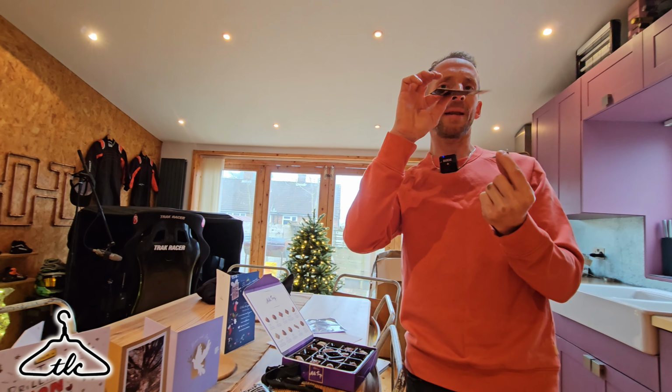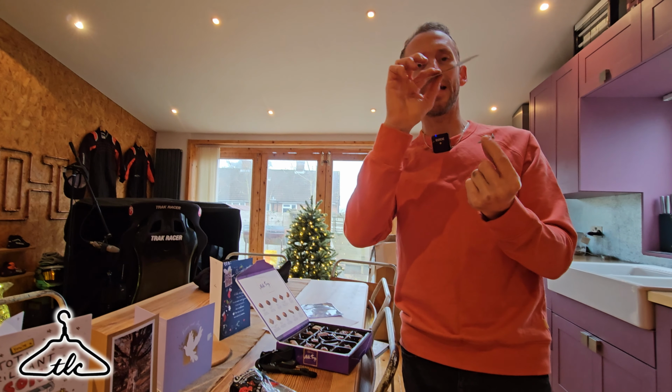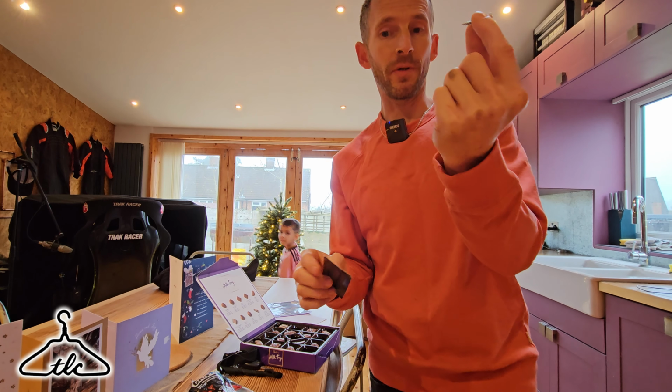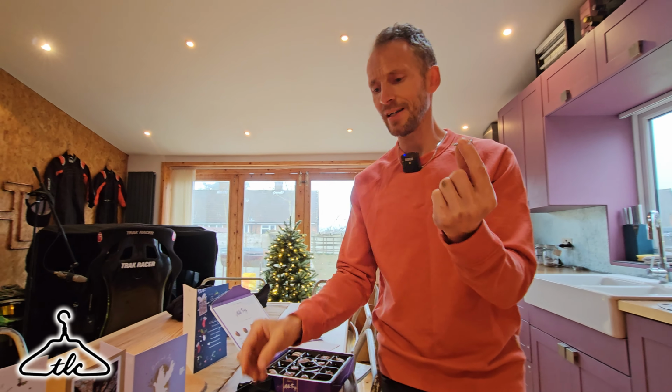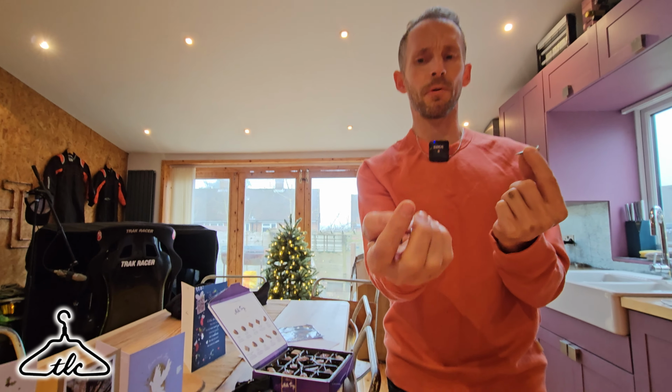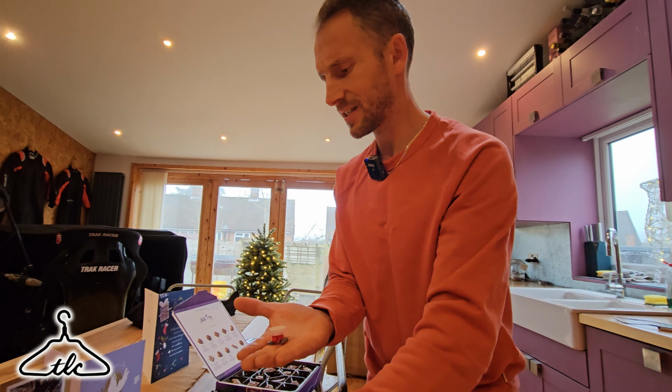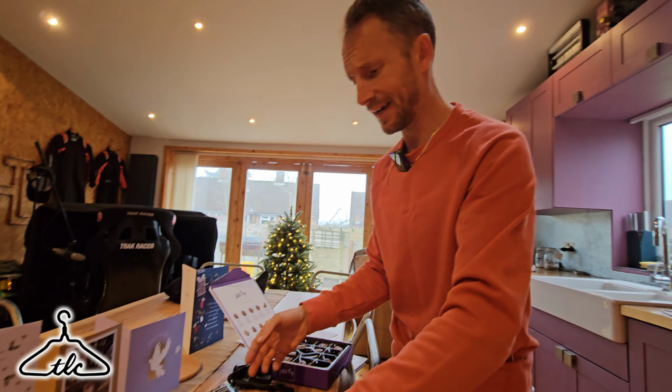But if you are fixing something thin, for example a plate, up to 5mm or so, give or take, then the 30s will probably work for you. But if you're fixing something thicker, like you see in the photo, my brackets, just go for longer screws. And that is why I liked these particular plasterboard fixings, because they allow me to use screws rather than bolts, and it was more versatile. Hence, having a whole bag here.